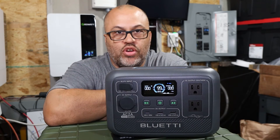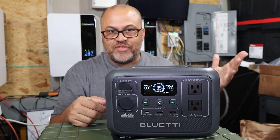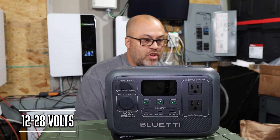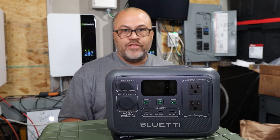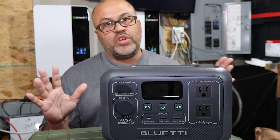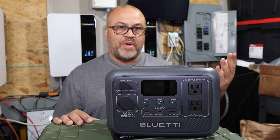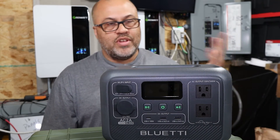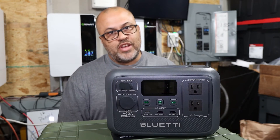If you have your own solar panels — maybe cheap glass panels from Harbor Freight or similar — here are the input specs: DC solar input is 12 to 28 volts, 8.2 amps max, 200-watt panel max. A single 200-watt panel or two 100-watt panels should work as long as the voltage doesn't exceed 28 volts. Just watch the amps at 8.2A — if you put panels in series or parallel, one configuration will push voltage too high and the other will push amps too high, so check your specs carefully.